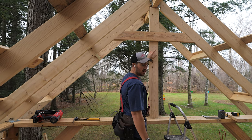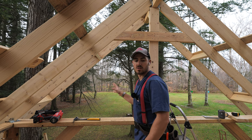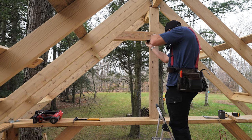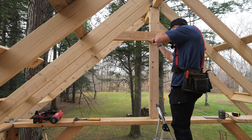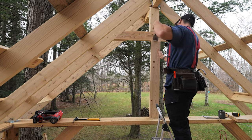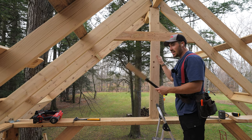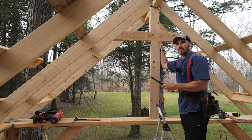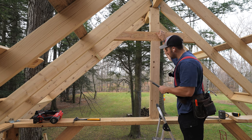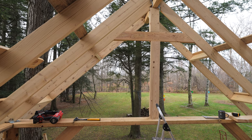I'm going to cut this out now. I cut as far as I could with my circular saw, then handsaw the rest out, and frame this window in. Pro tip: notice how my saw never got pinched — that tells me all the load is now on the header and none of it is on the old column, so I'm safe to take that out. Just a quick tip.